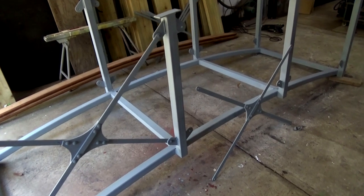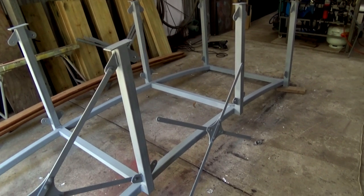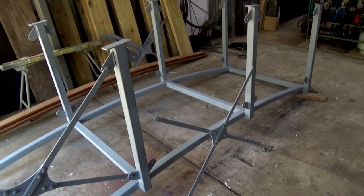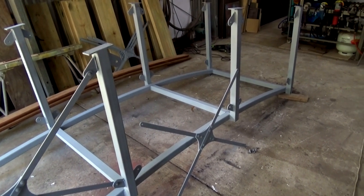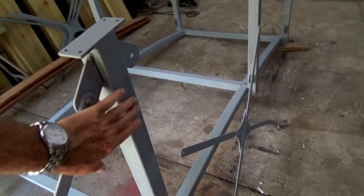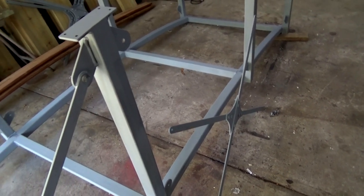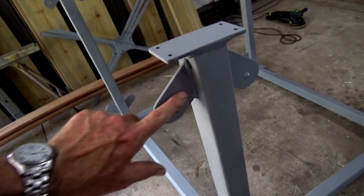This is just an update on where I'm at. What I have done is cleaned and painted all of the exposed steel. I ended up doing this with a brush — it was way easier than using a spray gun in this enclosed space, and I don't want to take it outside at the moment because we've got showers, rain and wind. So I've used the same zinc-rich primer, which on these galvanized surfaces just gives you good adhesion with the next coat. I took all of the diagonal bracing out to do this so I could get a good coating of zinc primer on this area here.